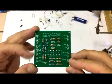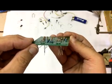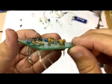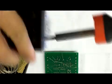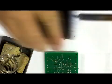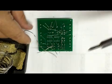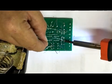Generally when you're populating a board like this you start with the shortest components first, which is things like resistors and the small disk capacitors. Just a few scrubs with that and that's good and clean. Get a couple of these things soldered in and then I won't bore you with having you watch every single one of them.